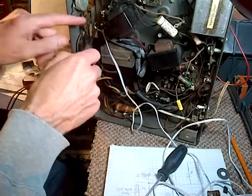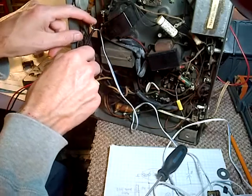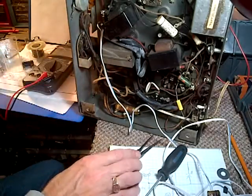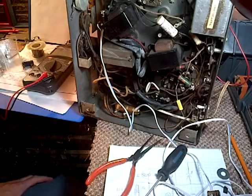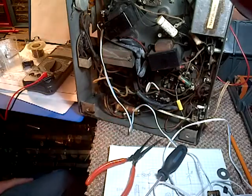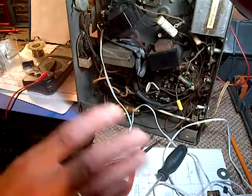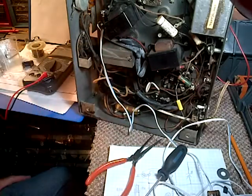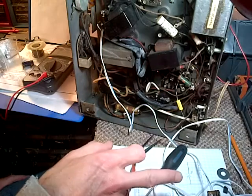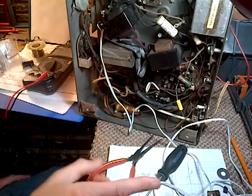I'm going to start the radio up on current limiting. I'm going to watch that. Watch the meter operate. If the current is too high, I don't think it can mechanically damage the meter. I think the movement will just swing. I mean, I've been swinging it with a magnet in there really hard. The coil itself can heat up, but that would take a bit of time.